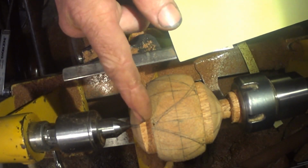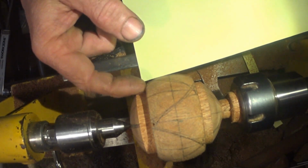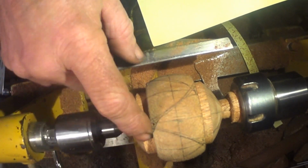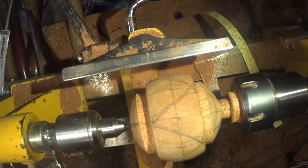So now I'm going to cut in 21 till the face of this either side measures 21mm, and that's going to be true of every cut after this. Is going to be the same. If this was in a sphere chuck now, this is exactly what we'll be doing in the sphere chuck later on.